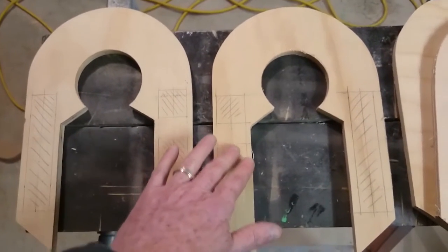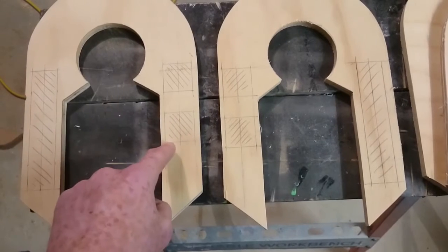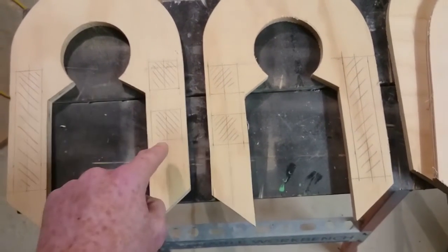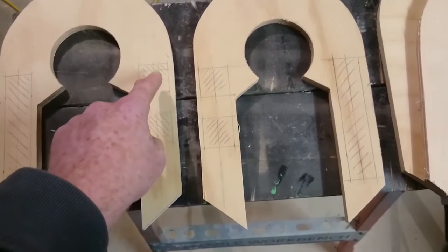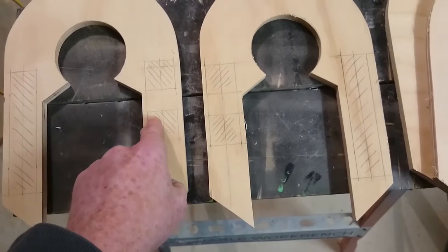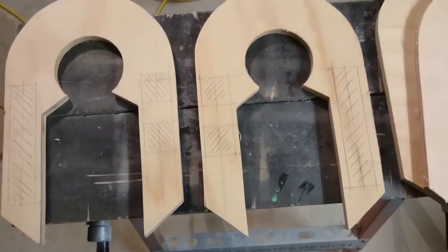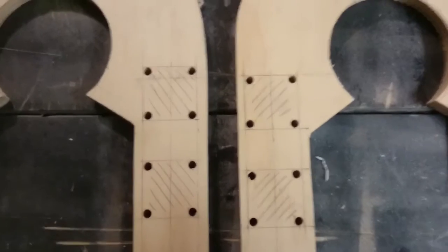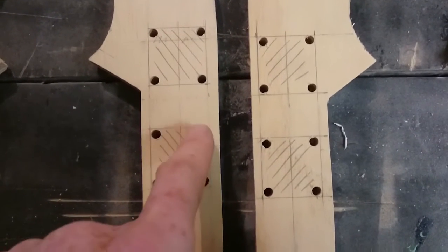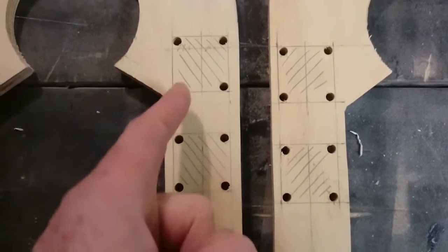You don't want as much depth in this hole as we do in this hole. Put a 5mm hole in every corner, and then a half-inch hole in the middle. A half-inch hole is going to be the jigsaw entry point. Then we're going to cut between those holes very carefully and try to keep it as neat as possible. It's very important that your 5mm holes don't cross on the outside of your line, because they're going to become your radius edge that you're going to file to.